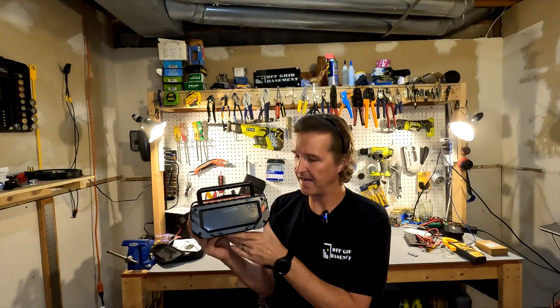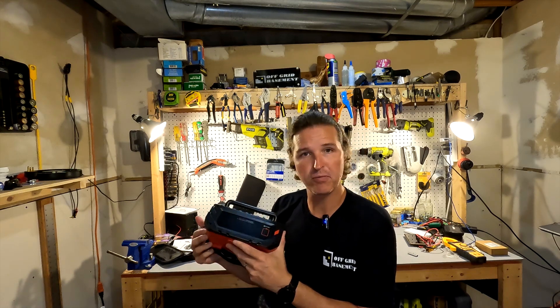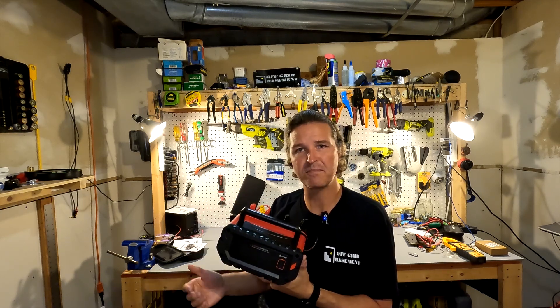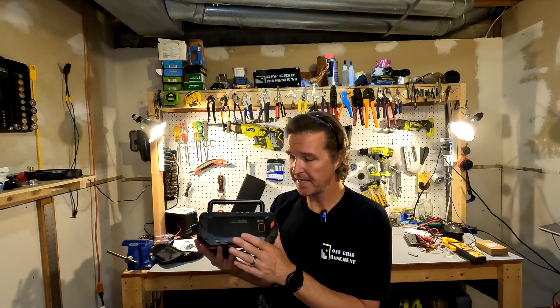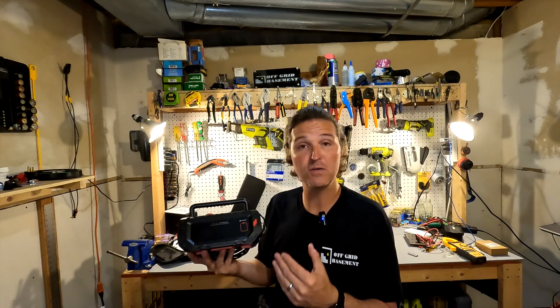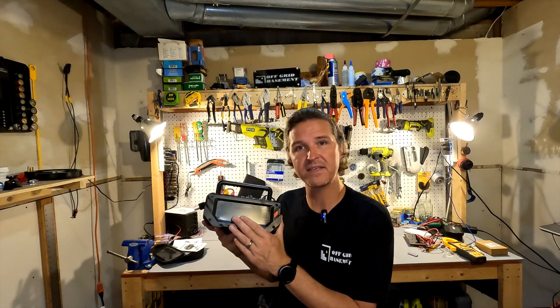So what do I think of the HTRC P20 Pro battery charger? First of all, I don't know why it says Pro — I couldn't find anything different between the Pro model of the P20 and the regular version. They may have just thrown 'Pro' in there to give it a little pizzazz. When it came to the charging abilities, it charged perfectly at the first two levels for both 12-volt and 24-volt battery configurations, but once it got up to the highest charging level it kind of faltered. The 12-volt battery I was charging was only at about 30 percent capacity, so this should have been able to charge at full speed with no problem, but it just couldn't get up to 20 amps.